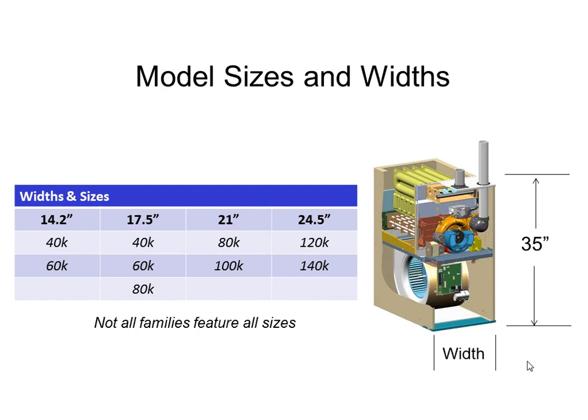The cabinet widths are 14, 17, 21, and 24 inch, though not every size is available for every furnace — you're not going to get 120,000 BTUs through a 14-inch cabinet. The 14-inch wide furnaces are typically available in 40,000 and 60,000 BTUs for condo replacements. On the opposite end, we don't put 40,000 BTUs through a 24-inch wide cabinet because the airflow would be too high and discharge temperature too cool. Sometimes a size is available in multiple cabinet widths — 60,000 can come in 14- or 17-inch, 80,000 in 17- or 21-inch.